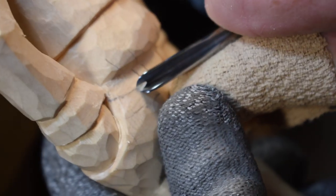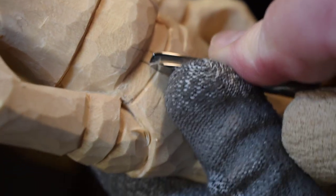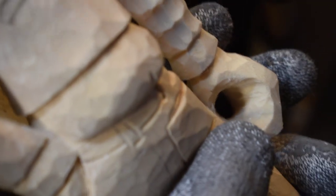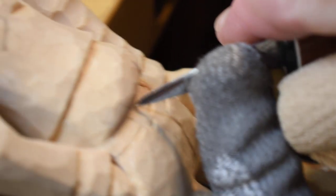We're going to turn it around now and I'm going to do the back side. I'll go in first with a V-tool right across here. Then you want to come down here where these belt loops are and get a little bit below them, to where they're kind of connected on the pants. I've got it already done except for the bottom. I'll go ahead and do this one over here. Now I'm going to recess that in there like I did the front — make a stop cut right in here, right across here, right down in here.